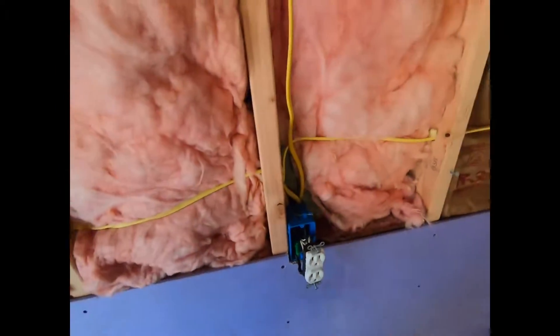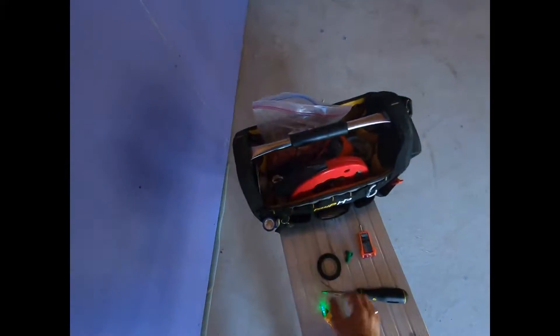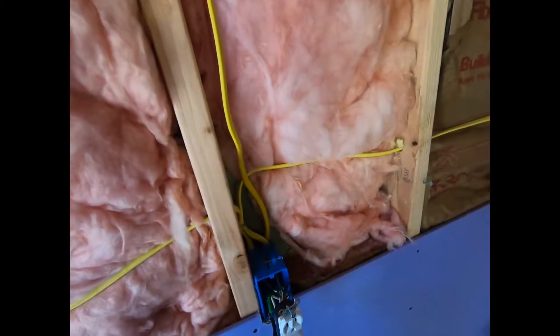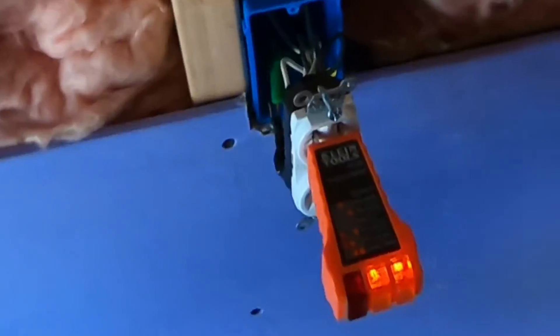Turn on the breaker — it's hot. My new outlet is hot. I also want to make sure your wiring is correct; the outlet tester shows two lights, indicating correct wiring. Same thing on the existing outlet — correct wiring. Hope this helps. Thanks for watching guys. Don't forget to subscribe, and remember I do flips and remodels, so check out the real estate playlist if that's something you're interested in.